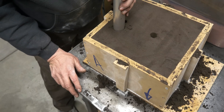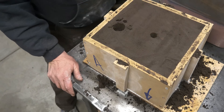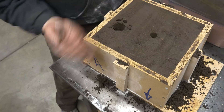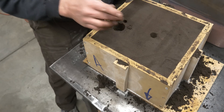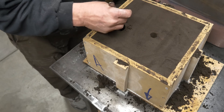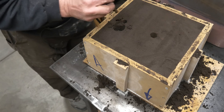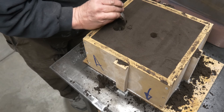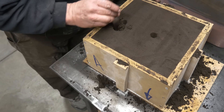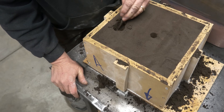I'm going to cut that out just a little bit more to clean up the bottom edge. So now what we've got is a nice, round, flat-bottomed pouring basin — not a spoon-shaped, not a bowl-shaped — a nice flat-bottomed basin. We're going to cut a ridge between the sprue and that basin.